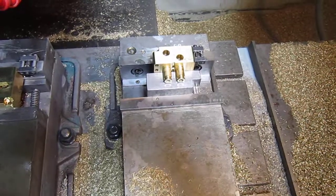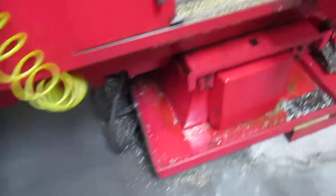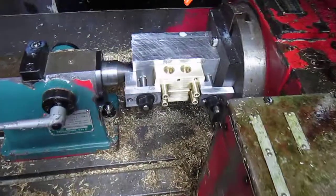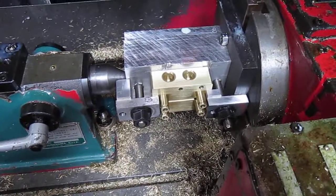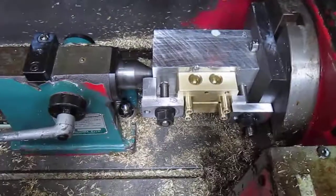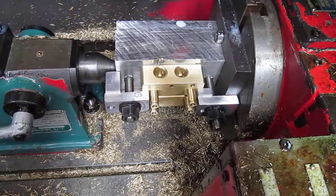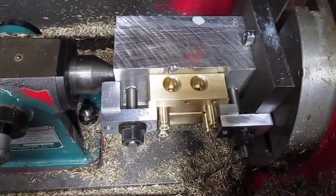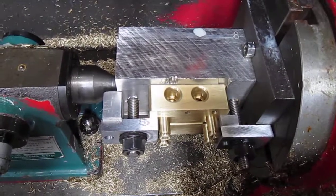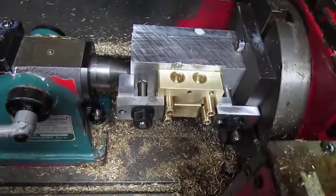We then move it to a second cell that we need to establish and put in side holes. They're designed for sealing of O-rings. We have a finish of 32 in the holes maximum. We radius so that they don't have any burrs in there, and we have these holes intersect the other holes in the front of the part.